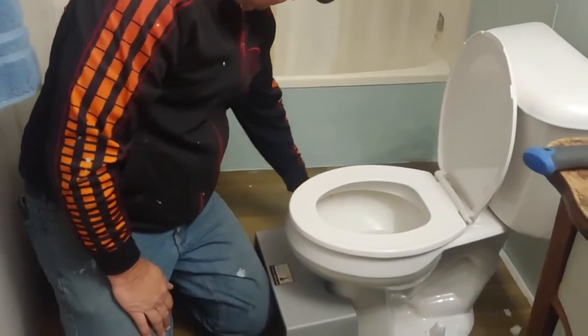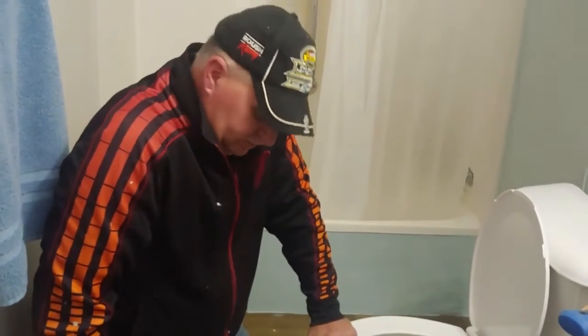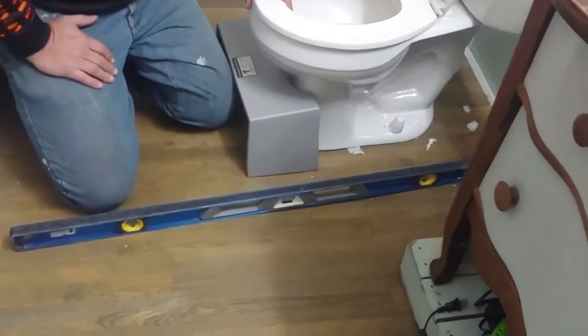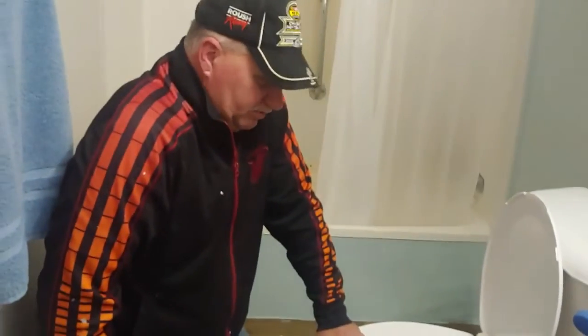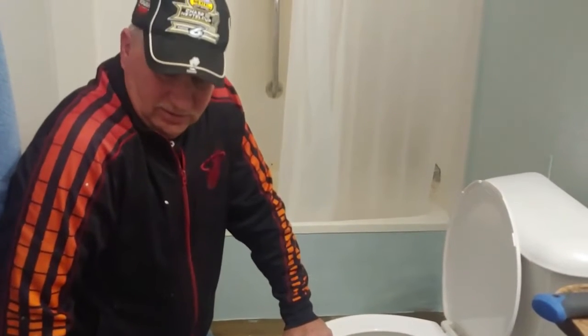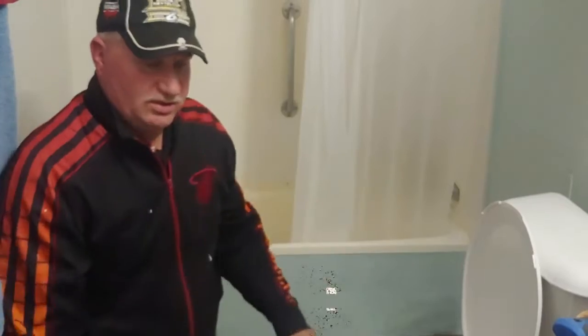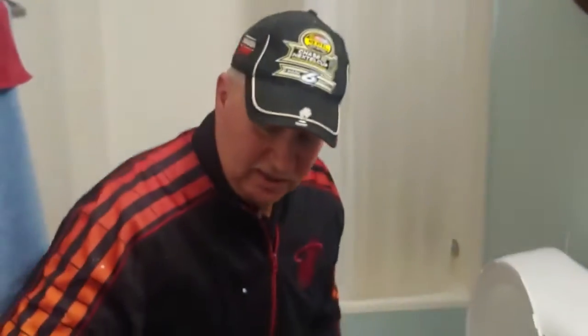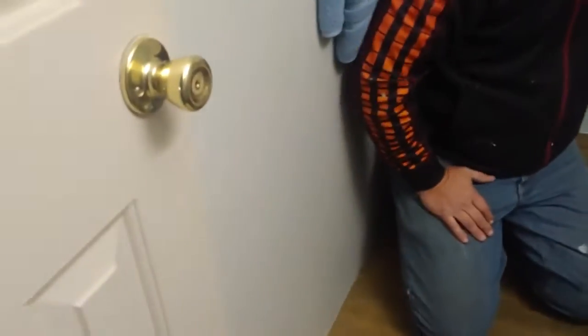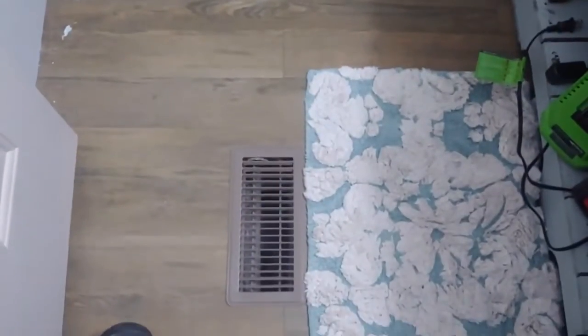It's warped. And so we are going to take all this floor out and then put it back better than it was, because it won't be particle board that we put in here. It will be something that's much, much better than adequate for flooring to last. So first thing we're going to do is take a picture of everything, that way, you know, knickknacks and shelves and pictures, and then we can take them all out, put them away. The next thing we'll do is take the door off, not necessarily in that order, pull the vent out and take the toilet out.